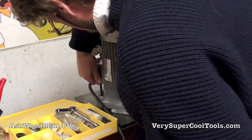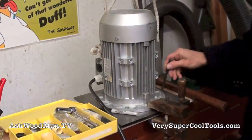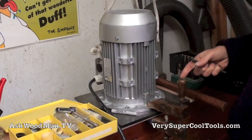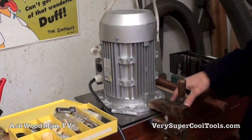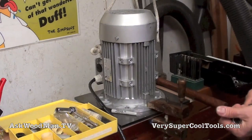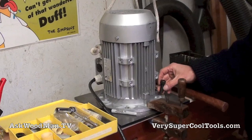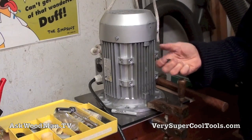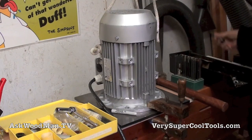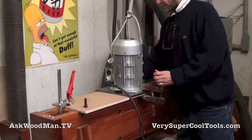Let me take it apart and go to the drill press to drill these out and tap these holes. If it was just mild steel I would probably do it with a nut and bolt, but I'm 100% confident in this 4140 - which is very close in structure to grade-eight bolts - so I'm just going to use a cap screw with a washer and lock washer and bob it off so it's not sticking out the other end. Nice clean look. I'm just going to drill and tap into this plate.